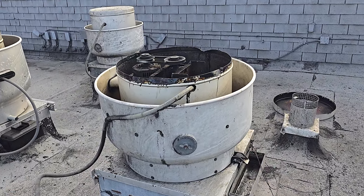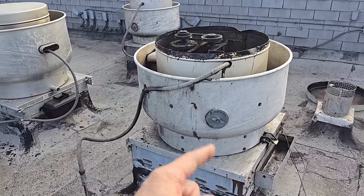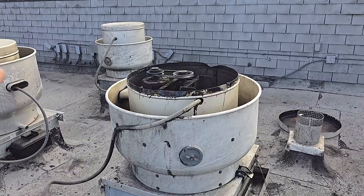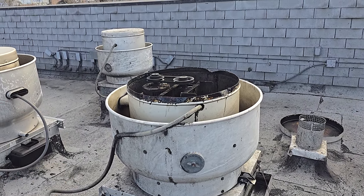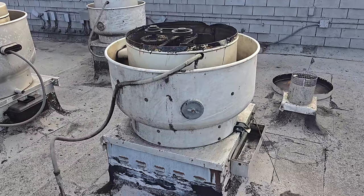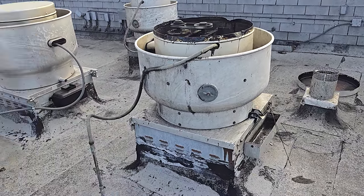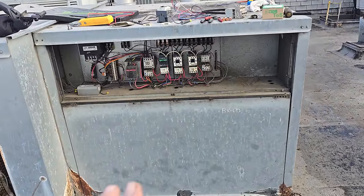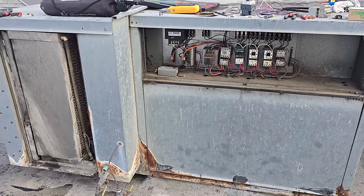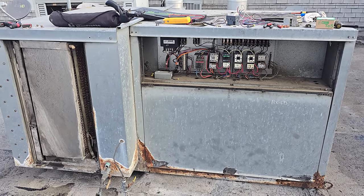I could put new bearings on this guy, a new shaft on this guy. If I was to walk away from this fan comfortably, I would do all new electrical conduit, put a power switch on the outside of it possibly. I would do a new motor because the whole thing is just trashed. All new electrical inside, both pulleys, shaft, bearings, and a wheel. So for all that stuff, the only thing I wouldn't be changing is the housing. You might as well just change it all and be done with it, okay? But we got the motor starter back in, protecting the motor like it should. Big picture, looked at the makeup air unit, got some information off of that so we can quote it. And that's it. It's time to clean up my messes and give the customer the keys.